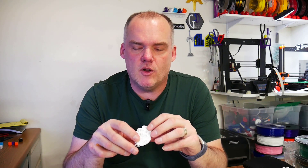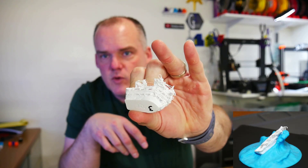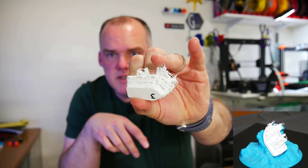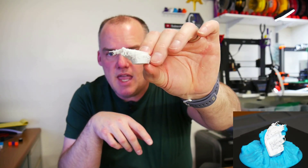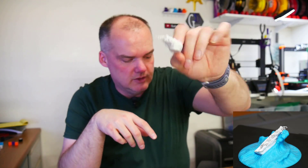I tweaked a couple of other things, but it wasn't very significant. On Benchy number three, I noticed a ton of really stringy, really heavy extrusions. I figured maybe the layer shift was being caused by the head ramming into a weird or off-kilter extrusion. So the next thing I did to tame the beast was set my extrusion multiplier to 80% — 0.8 in Cura. I also started messing with my jerk and acceleration settings because I could hear a popping sound as it was printing, though I didn't know where it was coming from yet.